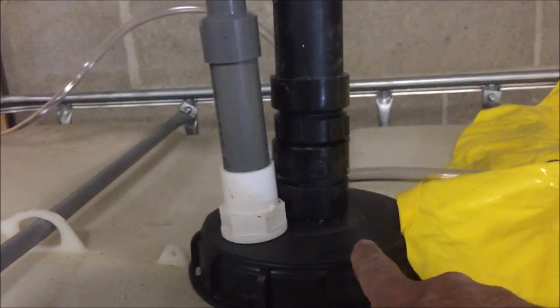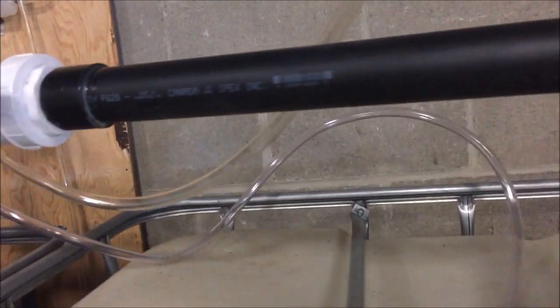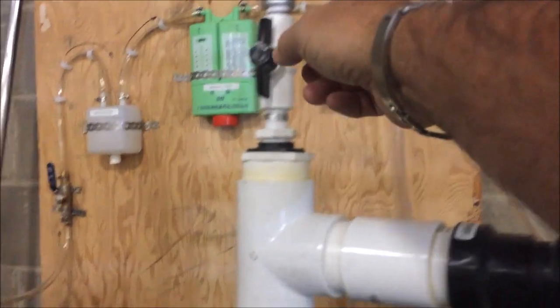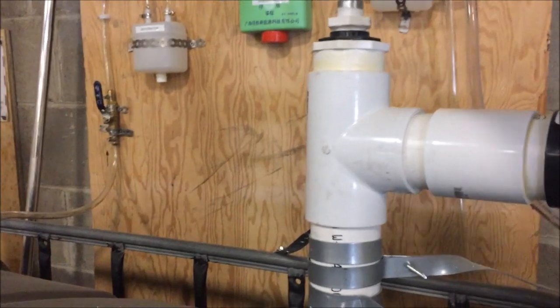It also has a union down here, and then as liquid fertilizer goes into this tank it displaces air — pushing the air out of that tank and using that air to help stop the siphon effect from drawing all the liquid out. That air then follows this other hose and goes into a storage bag.